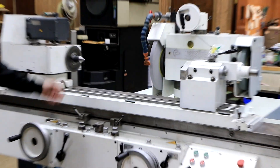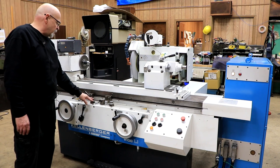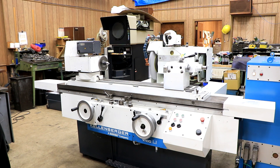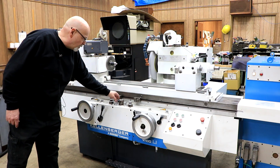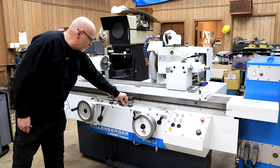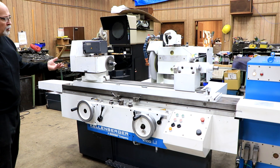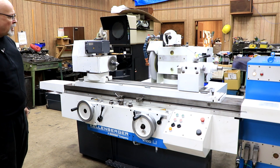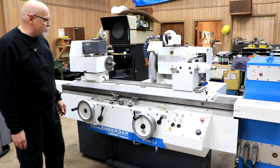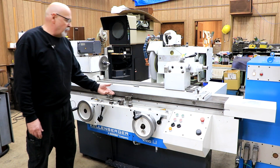So right now, if you want to go in and start a cycle: the wheel slide moves in, the table starts going, and the workhead comes on. As long as you have this mode selector set up for feeding on the left side and feeding on the right side, you'll see this move each time it reverses. If I wanted a dwell, I could set a dwell with both of these two knobs here — one or the other, or both sides. Table speed is here if you want to slow the table down. Machines are universal. When we spin the workhead around or use the face grinding attachment, you might not want to have this rapid in and out — you don't want that on ID grinding. So this lever here and this control has to do with setting that restriction so it doesn't move back at the end of a cycle.